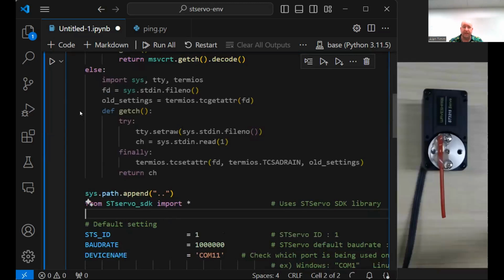All right, so if everything's set up correctly, this block of code sets up and opens up the communication port to that servo port. So let's run it. Oh, and that's it. We opened up the port and we changed the baud rate. Very good. Okay. So this third section of code. What's also nice about this is when we go to the next one where we go through how to move the servo, 3/4 of that code is the same. We're not going to have to copy the whole thing. We'll just copy the meat of it.